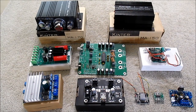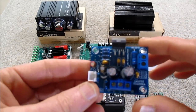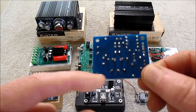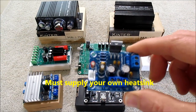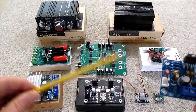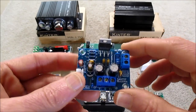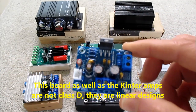In my opinion, the very best out of all of them goes to this little LM1875 board. It's a kit that you have to solder together yourself, but the board layout was excellent — looking at it from an engineering standpoint, how they laid out the grounds and the signal lines. They also provided a low-pass RF input filter, which is something I like to see. It'll get you probably a little more power than any of the other boards, with absolutely no issues with distortion or background hiss. These are excellent, and you can get them for $2 to $4. I'm also going to remeasure the power on these now that I have the new power supply.